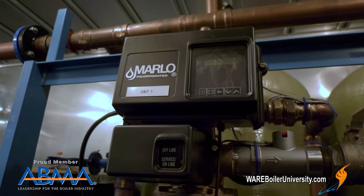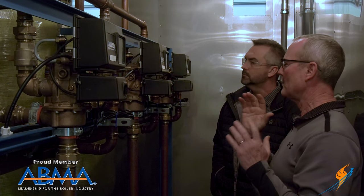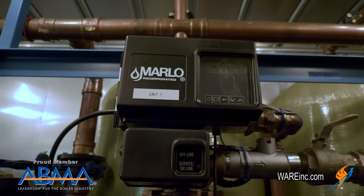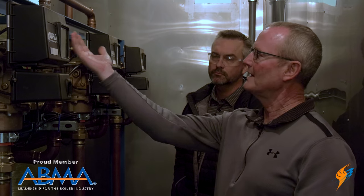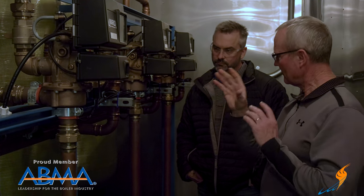On the valve heads, the old Aquamatic systems had individual valves all over each tank — half a dozen per tank — which were really hard to troubleshoot, with multiple diaphragms and multiple potential failure points. These new electronic single valves are multi-port but a single unit, so much simpler. You can program them, see the flow, check how many gallons have passed, and how many remain before regeneration. They're reliable, they take the pounding of going up and down the road, and we've added rubber behind all the pipe clamps as vibration eliminators.